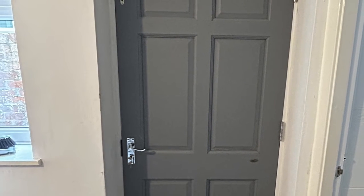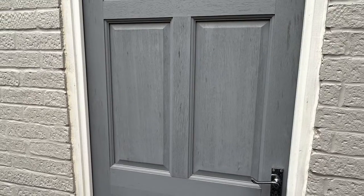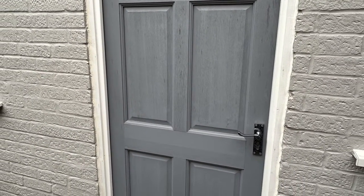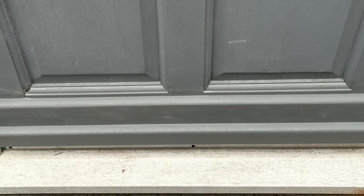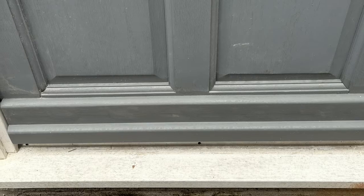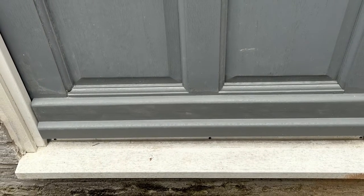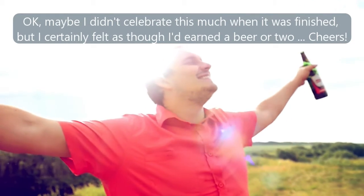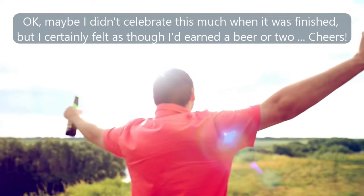The next step, as I've already said, is to rub down the door and frame completely, inside and out, and get some decent coats of paint on them to prevent further deterioration. Just need a couple of dry days. I'll probably also run some beads of weatherproof sealant along the bottom edge of each inset panel to try to prevent any water from getting down behind the rails, which is where I think the rot began. So what started out as a quick job to plane a little bit off the bottom of the door to stop it binding turned into a full-scale repair spread over 2 days in between bouts of rain.